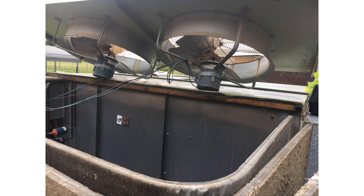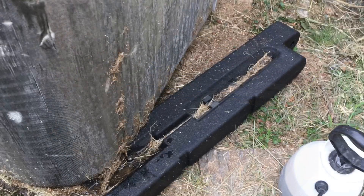The main work associated with it is you have to pull the top off. You have to pull the side access panels off and get to the end of the coil. And then you have to have something to kind of support that coil as you peel it away, so that it doesn't sag and damage the coil.